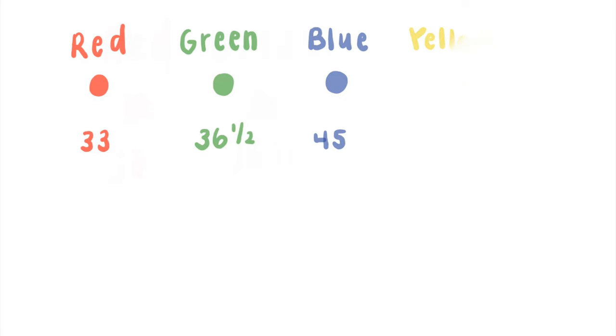So your first step, you're going to take 2 of the 33 inch boards and 2 of the 12 and 7/8 inch boards and attach those together. For me, I use pocket hole screws with my Kreg jig, but you guys can attach it any way you'd like.